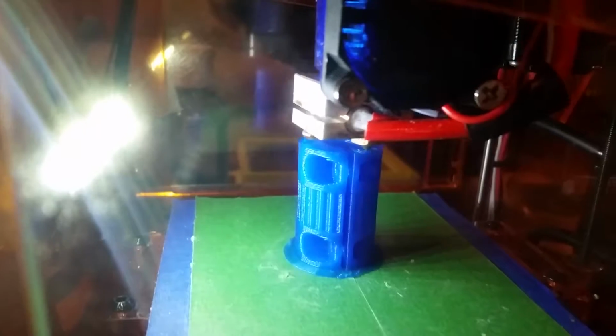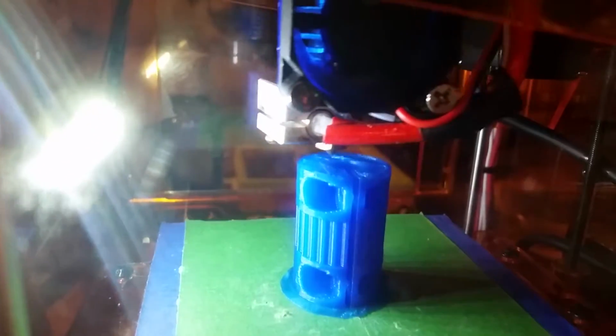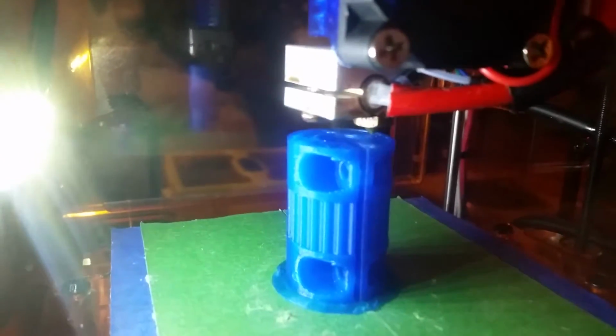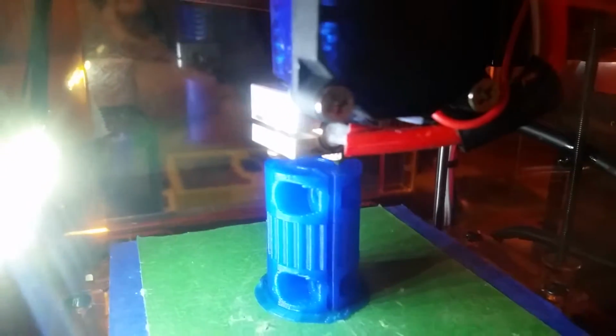Okay, here we go. Getting to the last layer of the print here, I think. Yeah. We're on layer 99 of 100. Yep. So it shouldn't take too long. Shouldn't be too bad anyways, but hoping this stays in focus. Looks like it was doing a good job. A little bit of drooping on the overhang, but that happened with the other PLAs as well. The top where the nuts and the little screws go. Can't really be helped unless I change the shape, but I think we're looking at, yeah, last layer here. About 20 seconds left, maybe.